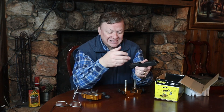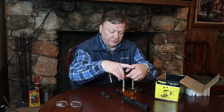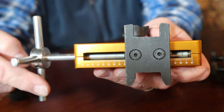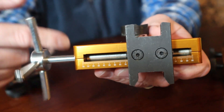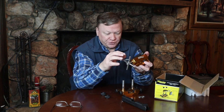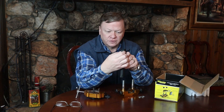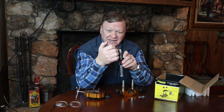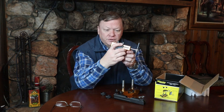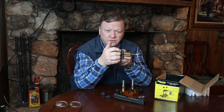Once you get the sights in the gun, to make your fine adjustments right and left, you can use these legs on here to move it just a little bit one way or the other, pushing left to right or right to left depending on how you need to move the sight. If you have a sight that instead of having 90-degree walls on the side has a bevel on the top of the sight, then you can change this piece and flip it over so that the bevel piece is down and use it to push the sight out.